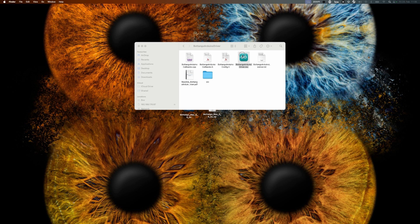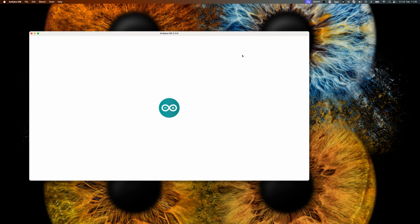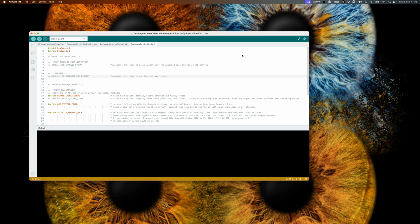As we are planning to use an Arduino Uno — in my case the Mega 2560 — in addition with the Adafruit PCA9685 16-way servo driver, we need to prepare the Arduino sketch that we need to upload onto the Arduino. To do so, you will have to go into the new folder, Botango Arduino driver, and double-click on the BotangoArduinoDriver.ino file. This will automatically start your Arduino IDE and bring you to the right source code. This video will not go into the details of explaining how to download and install Arduino IDE, as there are many videos out there for that.